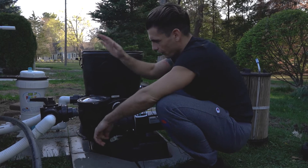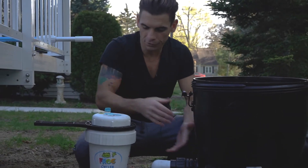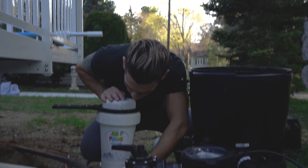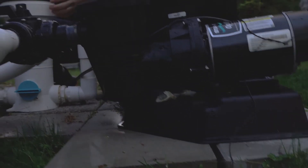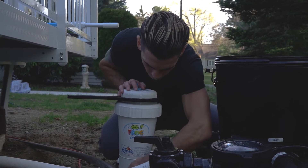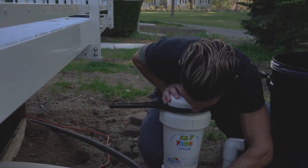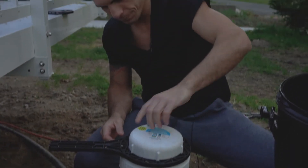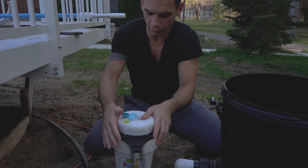So we've got the cartridge and the skimmer basket done — now let's talk about the chlorinator. The chlorinator works much like the filter basin itself, just a smaller version that holds chlorine. On top there's an air relief valve just like for the tank. On the dial you'll see numbers — on this setting, you want the dial to always be halfway up, which is the center. All the way down would be maximum chlorine. There's also a sticker that says 'pack removal' — when you put it on pack removal, it prevents water from coming back into the system. Open up the air relief valve and then use this wrench — it just slides on. Sometimes it's going to be tight because it's a brand new pool, just give it a little push and the whole thing will open right up.